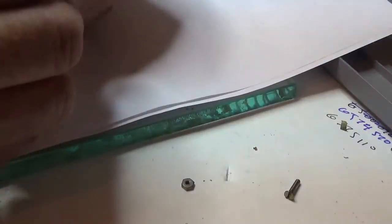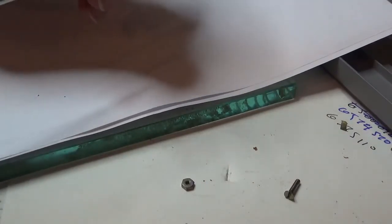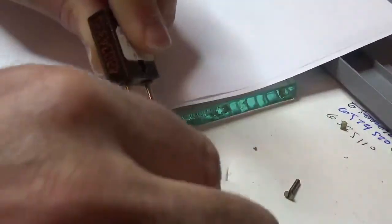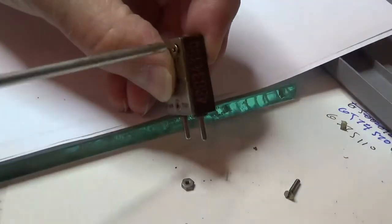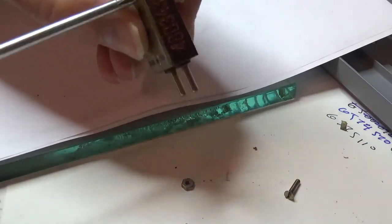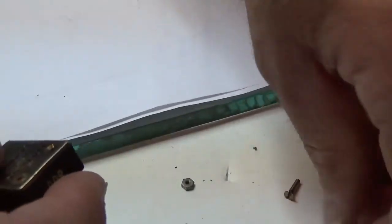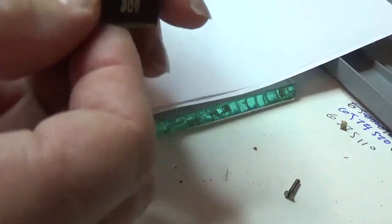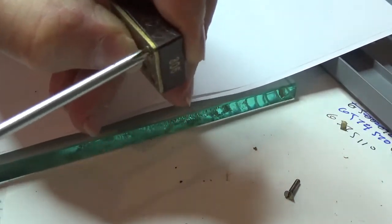Okay, the nut back in this upper one. Okay, we'll put the third screw in. This guy right here, because we're going to call it quits on this particular crystal. I've moved it close enough to where I want to be. Actually, not really, because I already got one that's about 7038, so hopefully this is close enough to 7035 to be part of my goal here.